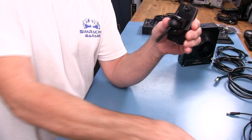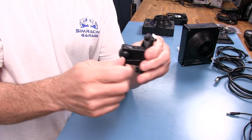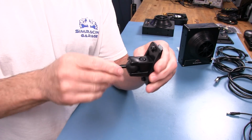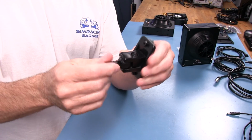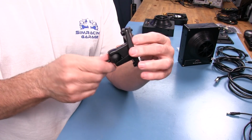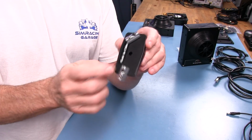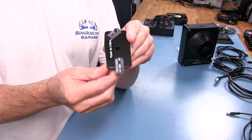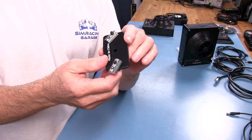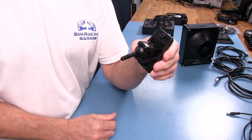But you can see the range of movement we have on something like this. It goes up, goes down, of course, goes this way. And of course, we can spin it this way so it goes this way. So this is a good solution for mounting a lot of things. I mount my speakers. I mount a couple other things with these on my profiles. This is really good. You do have to have, obviously, some T-nuts. And these are M5 bolts that fit in the holes. So M5 bolts you will need for that. But yeah, you'll see it when I have it mounted, how this works.